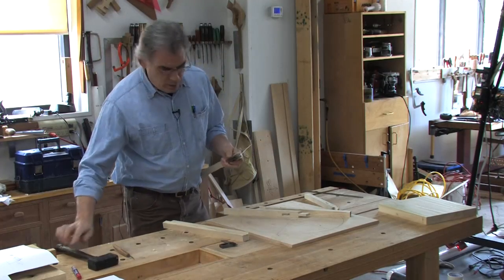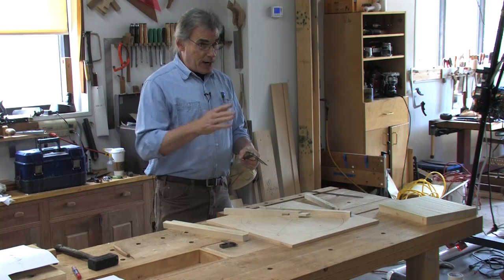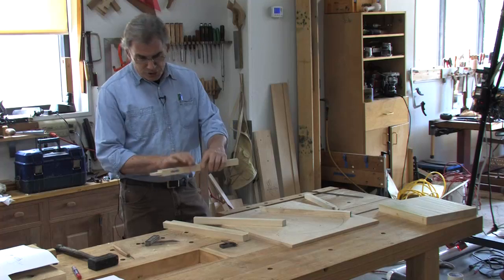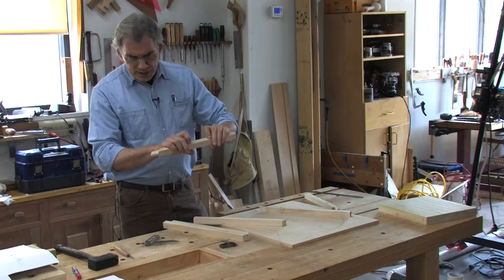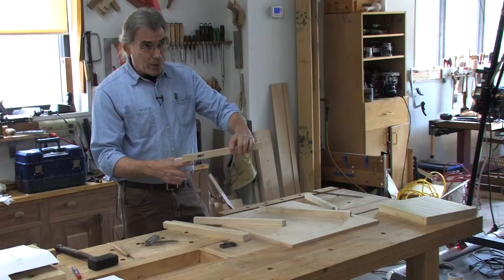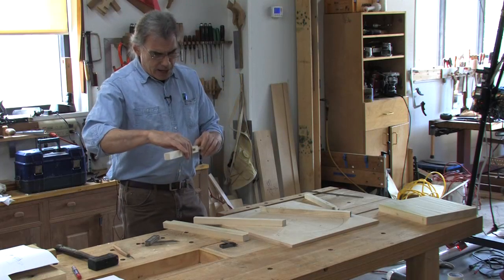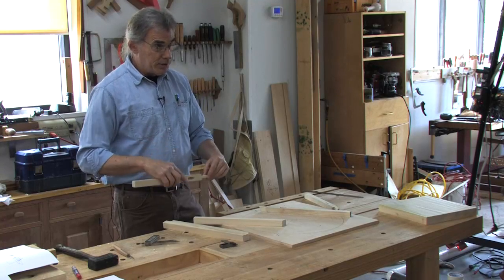You know, most of the time in woodworking, we're dealing with squares, so angles get a little weird and funky. We could cut these at the table saw. I could set the miter gauge and pass that over the blade and I'd be fine. It gets weird on this because if I flip it over to cut the other side, that's no longer what I want to do. So to do this with the miter gauge on the table saw or at the chop saw or radial arm saw, I've got to make 2 setups at just the right angle in opposite directions.